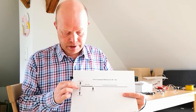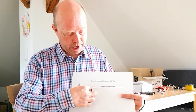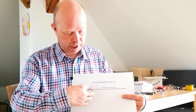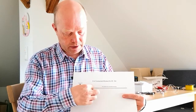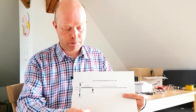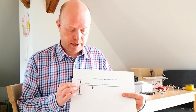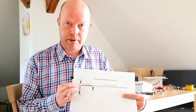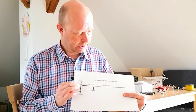And we'll talk about the kind of ferrites you can use here a bit later on. And here, where the inner conductor of the coaxial comes out, we connect just a normal bit of wire, and that becomes the long leg, and then the coax becomes the short leg. The beauty of this is now we have done away with the coax cable that would normally come down here, and we can connect with just a relatively short piece of coax to our rig, so it saves a huge amount of weight, and of course it's also very convenient when you can connect at the end like a normal end fed antenna. So that's basically it.